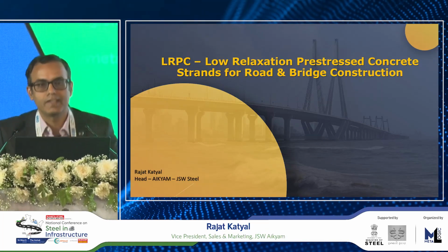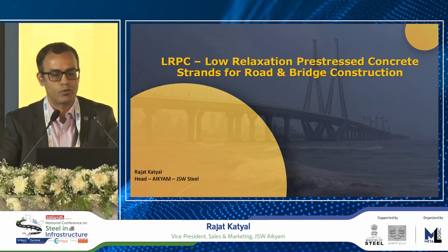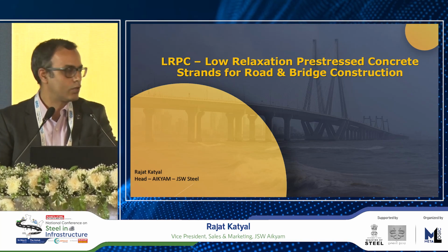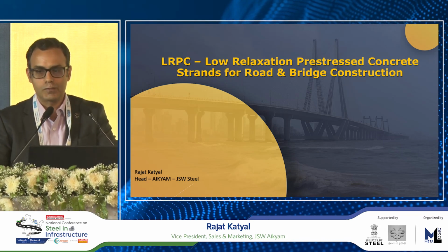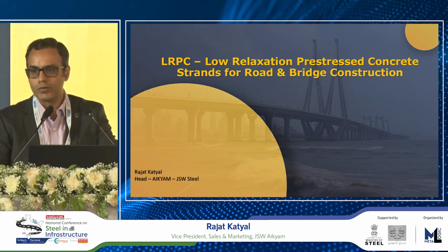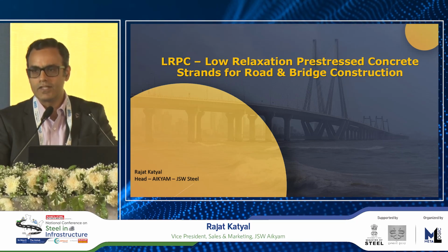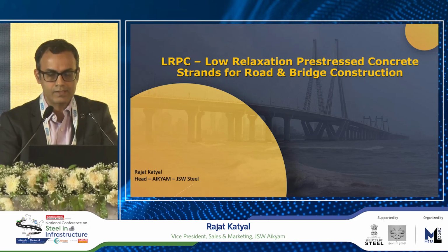Yes, thank you everyone. So I'll cover the entire piece around low relaxation pre-stressed concrete strands for road and bridge construction. However, first, in terms of what ma'am mentioned about corrosion, I think that's always a debate on whether epoxy coated reinforced bars are as effective as some of the corrosion resistant steel that we use. Generally, with epoxies, we have the challenges of chipping off, etc., and hence generally CRS steel or even stainless steel is considered a better option. That's our stand on it.